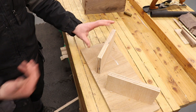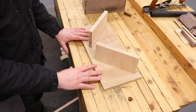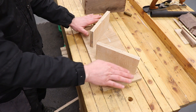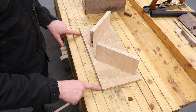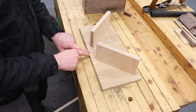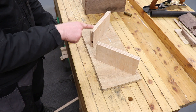I've skipped ahead to this part of the build because you've seen me do most of that stuff before, but this part is a little bit different. So I've made a jig for doing the dovetail mitre splines. It's essentially just a flat board with a flat straight edge on the bottom. I marked the center of it and then from the center point I drew a line at 45 degrees either side of center, which makes these two boards 90 degrees.